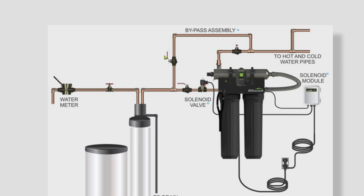As you can see in this picture, the bypass valve is actually open. The problem with these — in fact we just had one of these this week with a customer — the UV wasn't working. We found out they'd had some plumbing work done, and the plumber closed the inlet and outlet valves to shut off water flow, did the work, then came back and opened all three valves including the bypass. They had great flow, but none of the water ran through the UV system.